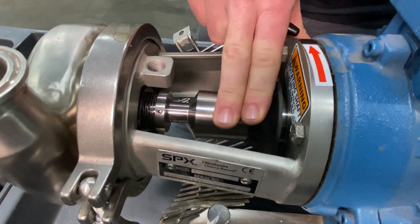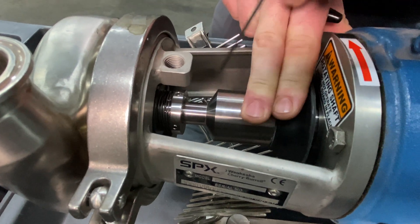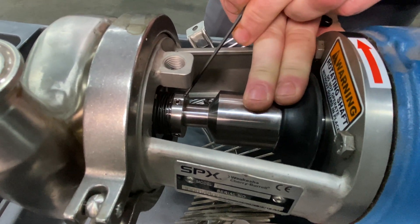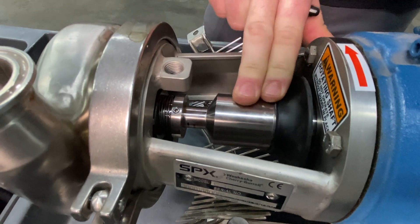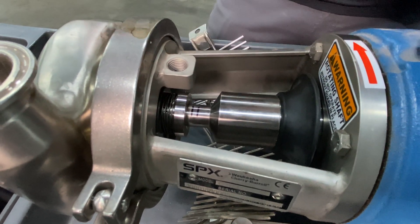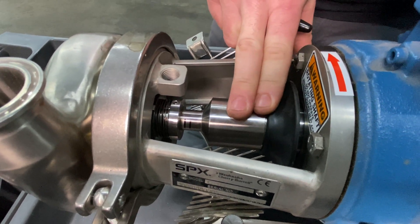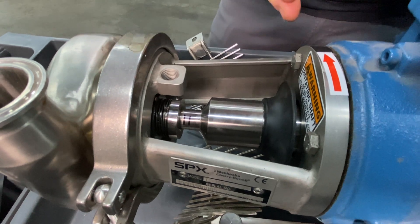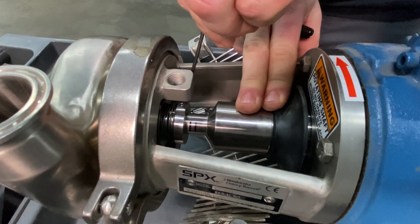After you get to this step, this is where you're going to need your allen wrench. Basically, these are the two set screws right here — what we're going to be doing is loosening these set screws to loosen the tension on this spring. This is a consumable item, so the carbon seal does wear out. What we did is mark some lines on here as guidelines — basically what we're shooting for. We're going to try to loosen it up about an eighth of an inch this time, so once you loosen these allens up...